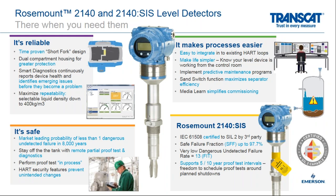Now on the flip side, if the fork started to corrode, that actually drives the fork frequency up. So depending on where your 20 milliamp point is, you may go up to 20 milliamps, you may even go into saturation, which is a good indication to go out and check the fork itself. So again, you can get advanced diagnostics if you just monitor the milliamp output of the device.